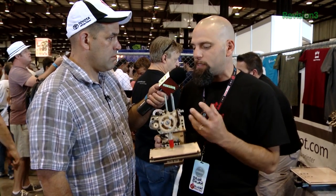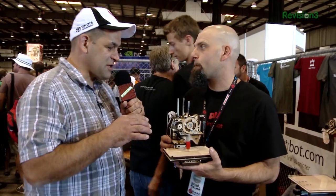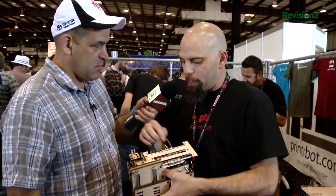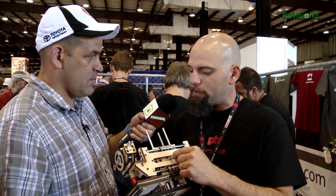You try to remove as much as you can, the least amount of material possible, so it did shrink down really small — three and a half by three and a half by three and a half inches cubed. I noticed there's no belts — you said it was Kevlar fishing line? Yeah, check this out. Belts do have a tendency to stretch sometimes, but Kevlar 200-pound test fishing line doesn't stretch. I can hang from it and it doesn't stretch. Guys have even removed the vinyl tube and gone right down to the bare metal with this, and some people think that doesn't work, but it prints.